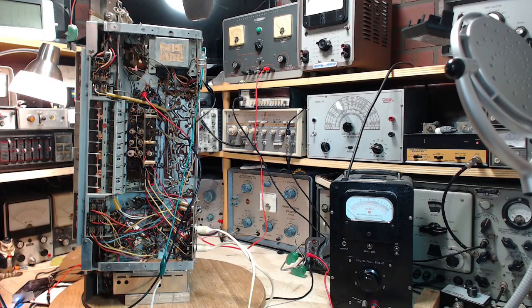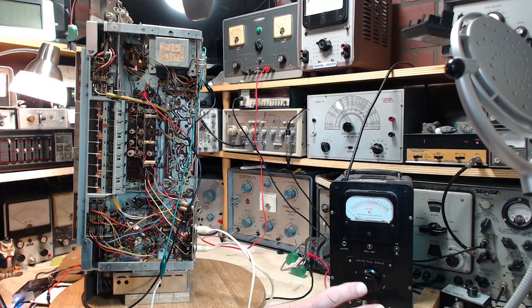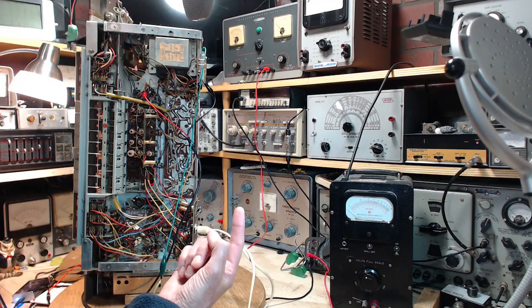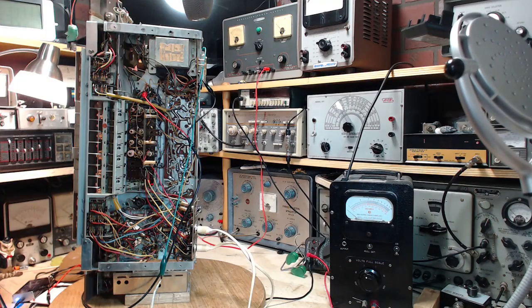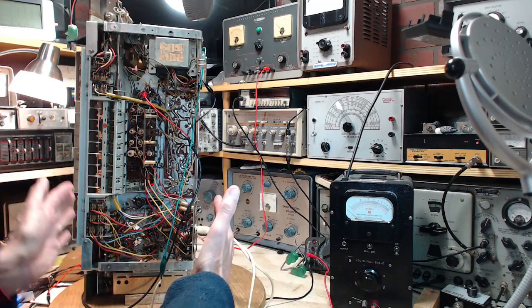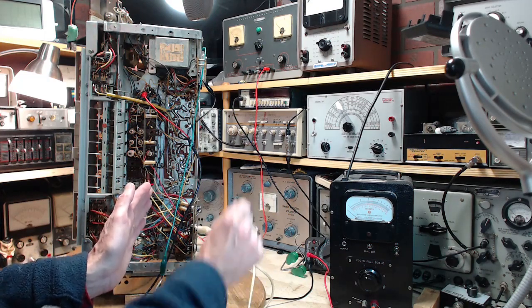Now, on the other side of the tube, things get a little more complicated, because coming out of that tube is everything that's going into it. So that would be all the antenna signals going right through that tube, coming out on the plate. The single local oscillator frequency going through that tube and coming out on the plate. And then the mixture of the local oscillator and all the signals coming in on the antenna, the sum and the difference frequencies are coming out too, and that will include frequencies all across the spectrum. Just basically the AM band gets shifted by the local oscillator, and then the IF can only see a little piece at the 455 kilohertz, or 460 in this radio, 460 piece.